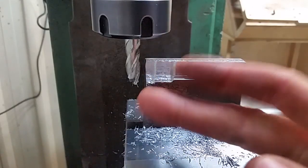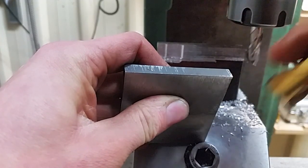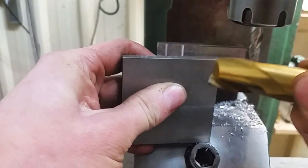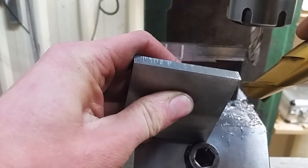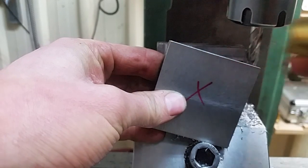Alright, I think I've proven the point. Let's now look at the dangers of milling on the side of the plate. Cutting on the side is actually fine — the issue is when the end mill first cuts. When the first cutting edge touches the plate it's going to grab and scoop the part longitudinally. The plate will rotate and the end mill will walk over the entire surface.